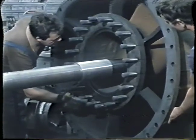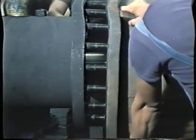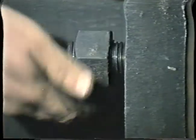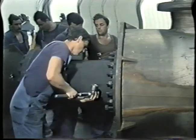These are the multi-stage vertical condensate pumps. They are driven by 1,300 kilowatt electric motors and pump 280 litres per second with a head of 280 metres. The length of the pump is 7 metres and it weighs 6 tonnes.